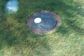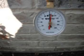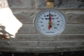This is the water meter and isolation valve to the house. Up here, in amongst the bushes, are the clean-outs. There are two, one next to the foundation, one just in the bushes here. They're used to clear the sewer should it get blocked. The water pressure is too high, it reads at 100 pounds, it should be no more than 80. In fact, it should be between 40 and 80, so you're going to need to have this regulated down.